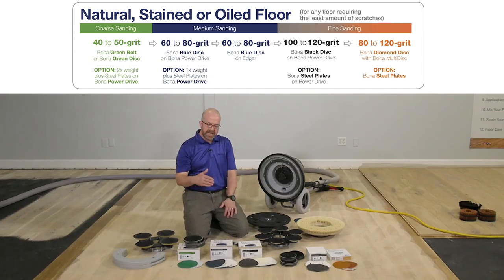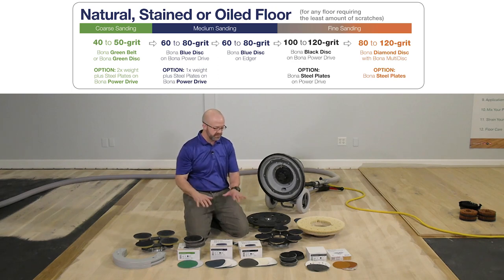Again, traditionally, guys would cut their filler off with a big machine, right? But our goal of the filler and putting filler on is to leave the filler in the floor. Your big machine vibrates so much, and just the way that it cuts and pulls, it tends to pull a lot of that filler out of the floor.